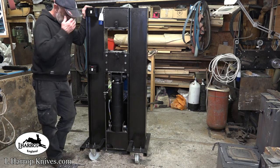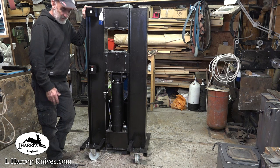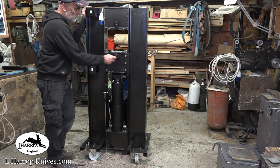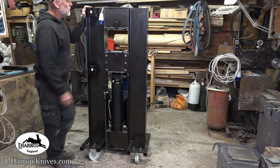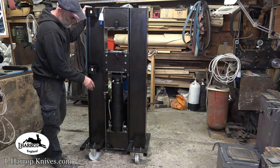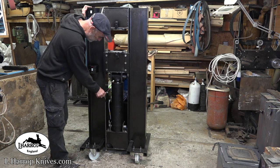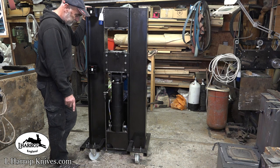So I reckon it's taken me possibly about 4 days start to finish to work on it, to get everything done. And as always with these things, it's the little messing around things that take forever. Drilling and tapping M10 or M12s, M12 bolts or 12mm bolts, 3/8 plate on the side of these. Making all these little adjusters and caps and things like that, the mechanism to get the actual control valve working properly, so you're not having to apply tons of force on this, just figuring out which is the best setup to get what you want from your foot pedal.